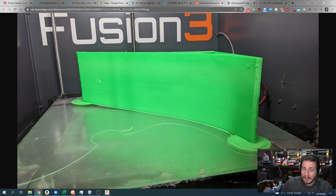And that's why we do prefer PETG for parts like this, or even PLA in some instances, because, well, those two materials are much less prone to warping and considerably easier when you look at big prints like this. Now, if we did have a fully heated chamber, we might have been able to stave this off, but because we're relying just on the heated bed of the printer itself, it's pretty much a fool's errand.